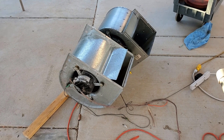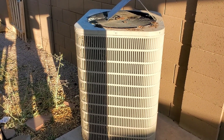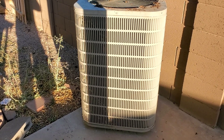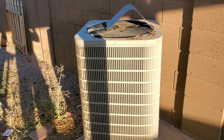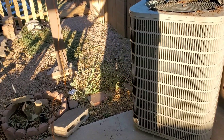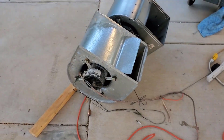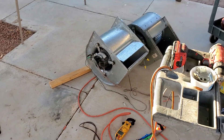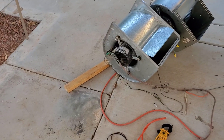With mine it's still going to be run connected to the house, but if I hack my main AC unit I'm just going to put in a three-phase compressor. I have this extra Goodman unit that's been behind the fence — it's from a changeout I did; the indoor unit leaked but the outdoor unit still works. Got a five-ton scroll in it, though I think that was noisy. Coils are in pretty good condition. It's been sitting under the tree. I'm thinking of putting a three-phase compressor in that and swapping it out with my other Goodman unit, leaving the other one intact just in case. It's been out there in the rough where I keep spare parts — no man's land.